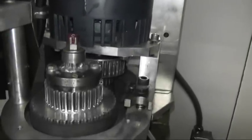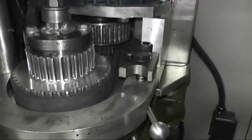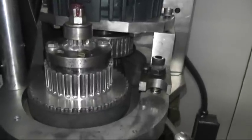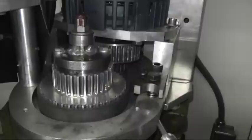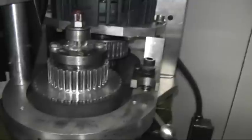The motor is a three-phase 3400 RPM two horsepower motor. The spindle is driven by an HTD 8mm timing belt. The pulleys I made, but they were the biggest pain in the butt. My fourth axis wasn't quite strong enough, so I had to sit there for 3 hours and loosen and tighten a nut while it machined the slots there.